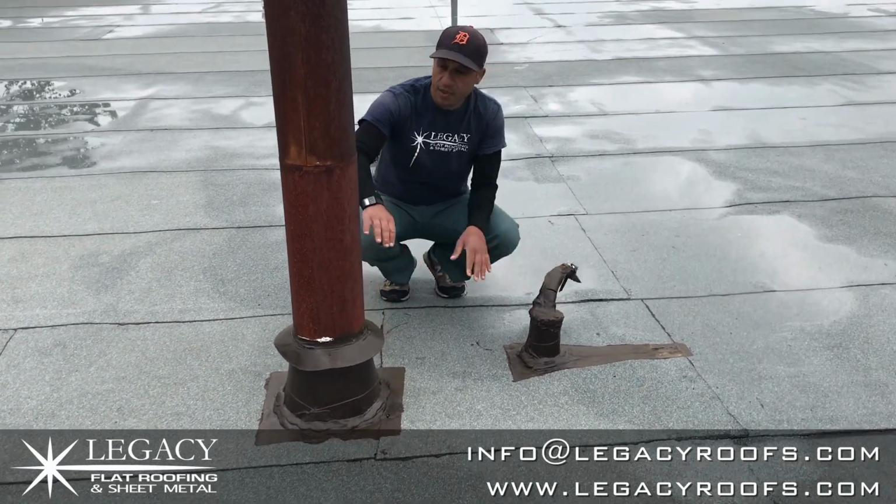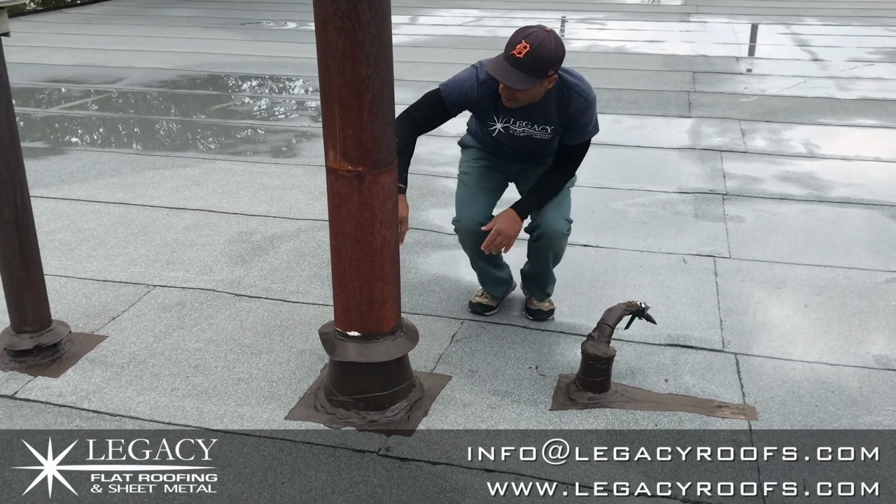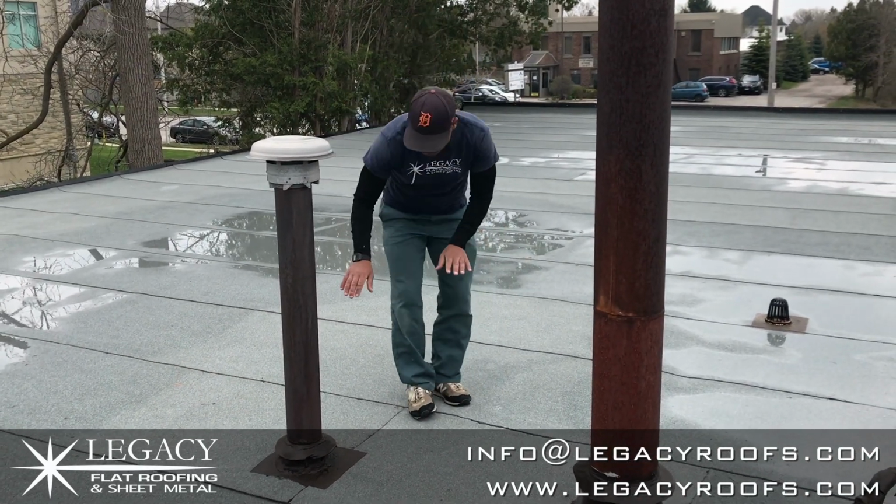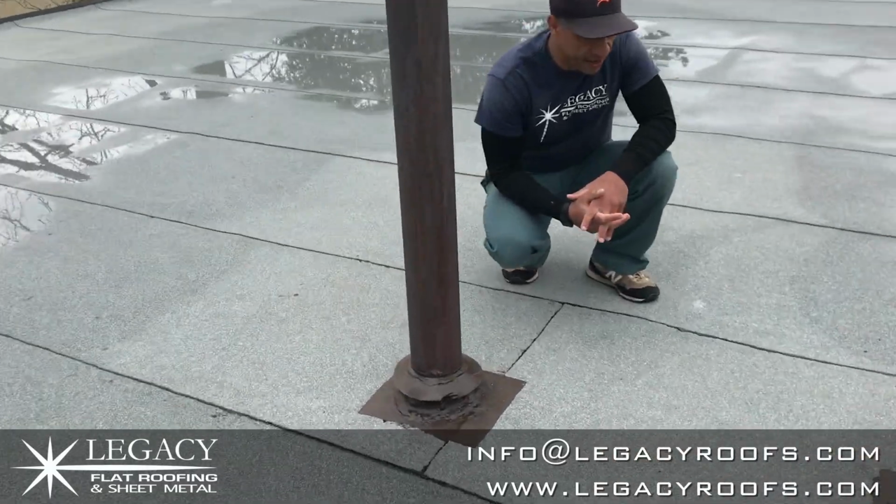We roofed this in. We have a B vent, a hot air stack, and this is venting a hot water tank. So we roofed it in. You can see our detailing down at the base.